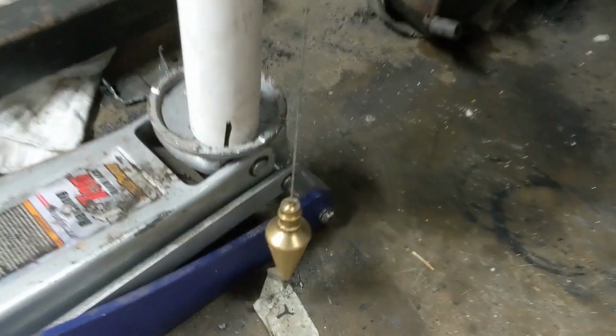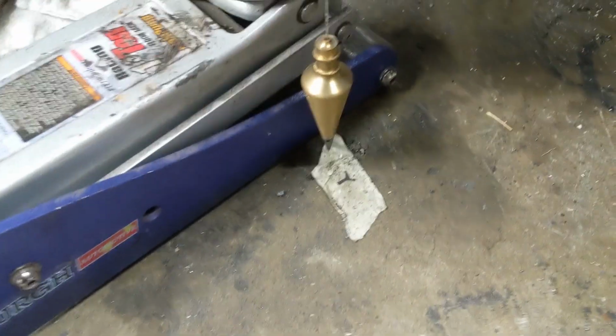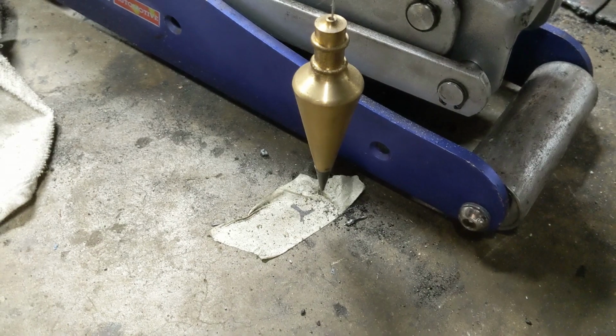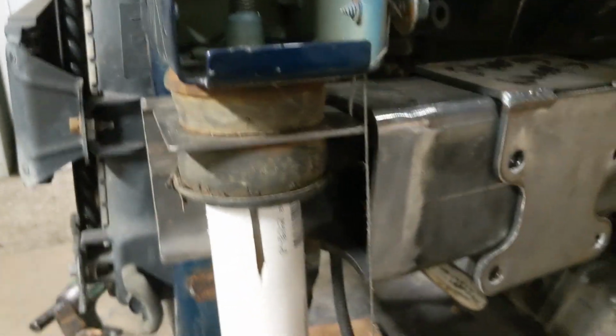This is exactly why I waited until after I welded the passenger side frame to make any commitments on where I'm going to put this body mount up front. So as you can see, it pulled that thing about an inch away just from all that welding. I've got it bolted down, but there is slop in the body mount bolts in the holes. You can loosen it and it'll shift it around a little bit. So I'll loosen that. And once I've verified that it'll reach, we can weld our body mount plate in and move on to the next thing.